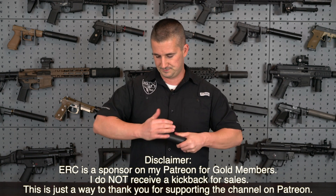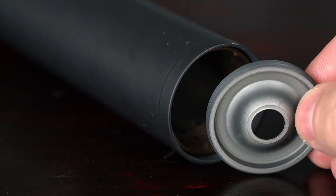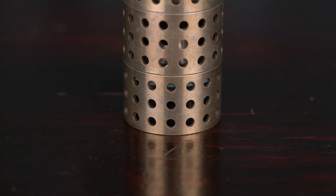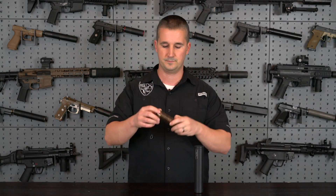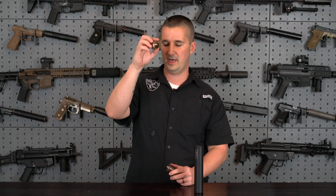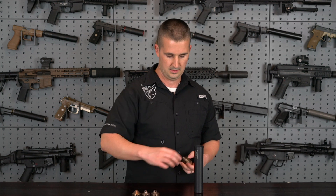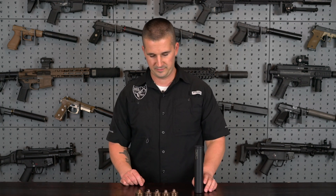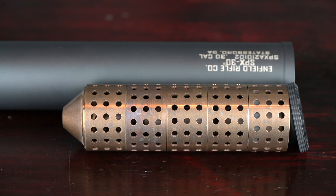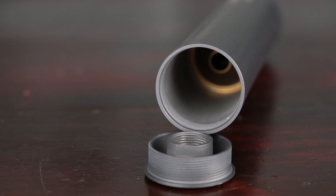As far as user serviceability, I just remove the front cap — 17-4 heat-treated with the finish on it — and then slide the baffles out onto the table. What you have here is a five-baffle system, machined from 17-4 heat-treated steel. Your first baffle is a cone-type with no notch, just a straight cone baffle, and then the subsequent baffles have your typical U-notch. Five baffles in a suppressor that comes in at seven and a quarter inches gives you a very large blast chamber area, which is probably helping with back pressure by letting a lot of gas expansion happen before it backs up at that first baffle.